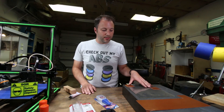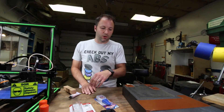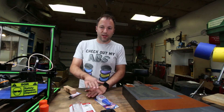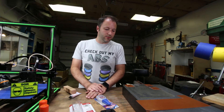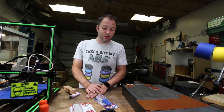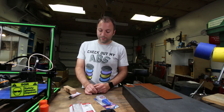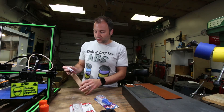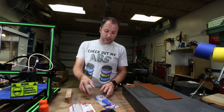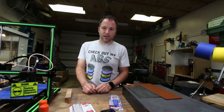Once I did that, the machine moves up and over, does its little purge, and when it moves back it has accounted for that Z zero offset we put into our Simplify3D settings, and you're ready to go. Really, this makes nylon just that much easier to print. McMaster-Carr ships, and there's a link down below for buying that. This Loctite Go2 glue has worked pretty well — if I find out there's a problem, I'll make an update.